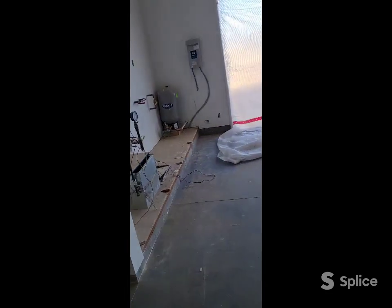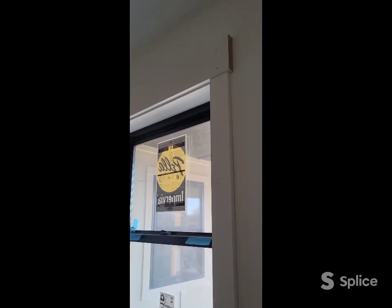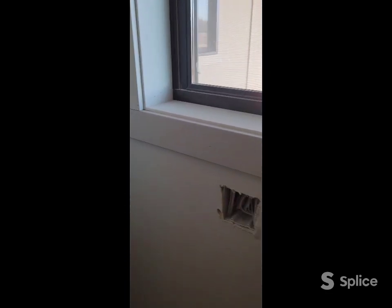I've done some work on the doors and the windows — that's the way to keep the doors closed. Here's the first window. The homeowners wanted just a little bit of an overhang on the header. It's called five-quarter; it measures out an inch thick. And why they call it five-quarter I've never really understood, because wouldn't that be four-quarter? So five-quarter material — five-quarter by six — with some one-by-four casing. We did a one-by-four apron on there. They did not want a windowsill.